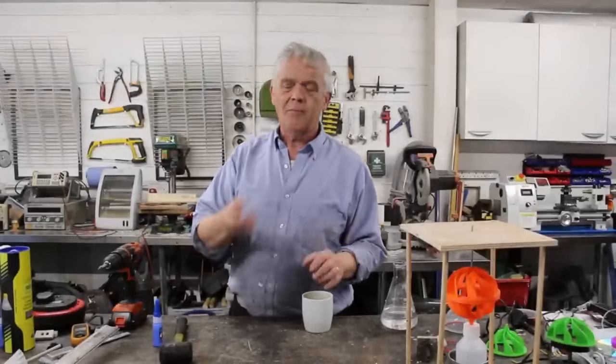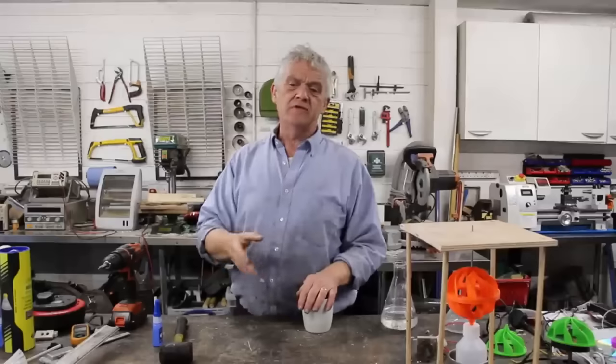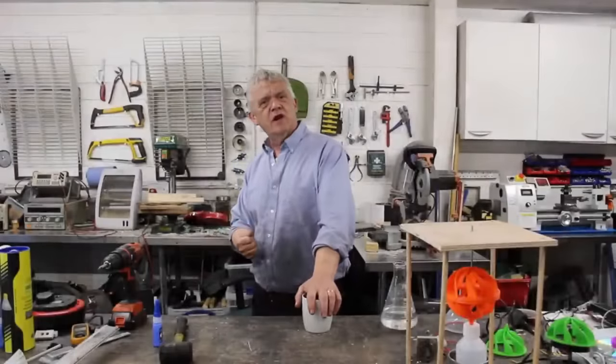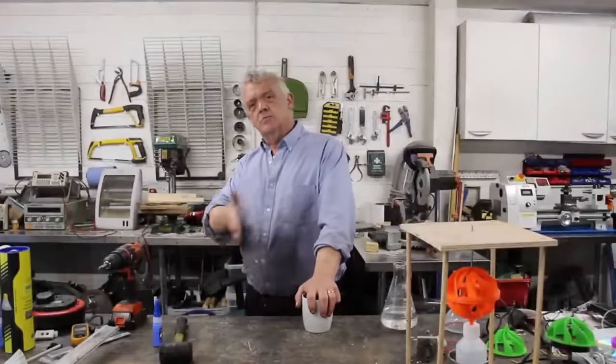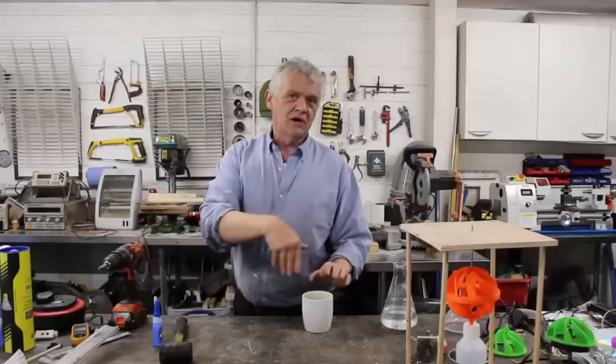All of that is what goes on in a standard electric heater. The claim with Ohmic Heating is that when you're heating the water, because you're not heating on the surface of the plate, you don't get salt deposition. Because you don't get salt deposition, you don't get limescale buildup. Because you don't get limescale buildup, you don't get reductions in efficiency. So the thing is much more efficient. That's the claim — look at Heatworks.